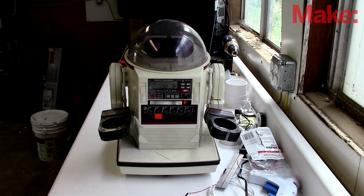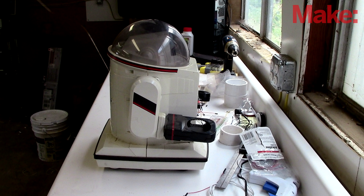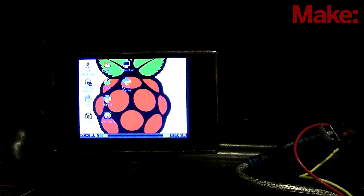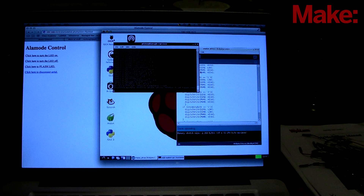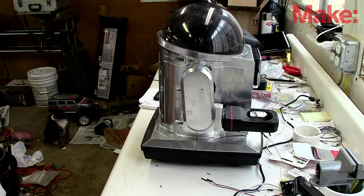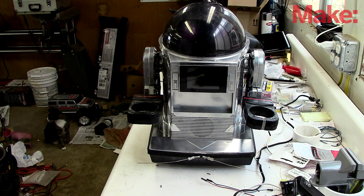What I started with was an old robotic toy — one I used to play with when I was a kid. It had one direct RF link and a little bit of automation capability, but no digital I/O to speak of, nor analog inputs. I gave it a new brain in a Raspberry Pi, a new operating system with Wheezy Linux, a little more muscle with an Arduino and a motor shield, and gave it multiple ways of interface via the web, SSH, or even a direct interface. What we have now is an updated robot that can be programmed with automation sequences, timing, can play media, has multiple digital I/O, and even analog inputs — a platform we can do almost anything with, reprogram, repurpose, and redo as necessary.